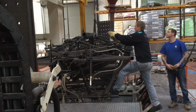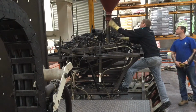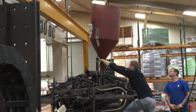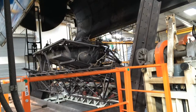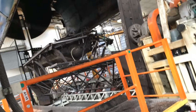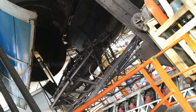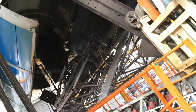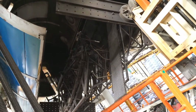So there's three layers to any plastic boat. The first, which is just the polyethylene outer layer, which gives it the tough rigidity. Then the inner layer is a foam that once it reaches a certain temperature, it expands to make that inner layer. And then the final layer is a layer of natural polyethylene to give the rigidity on the inside.